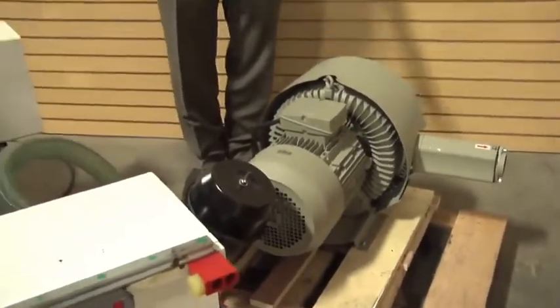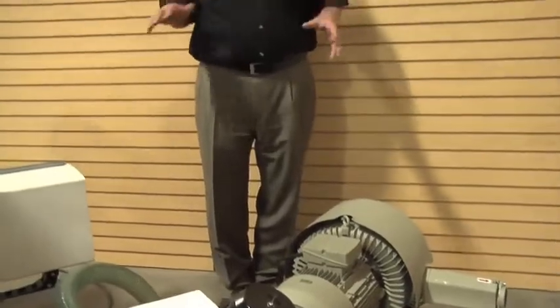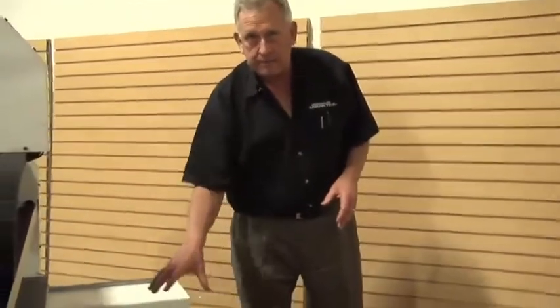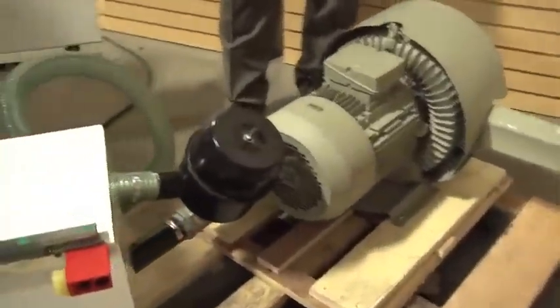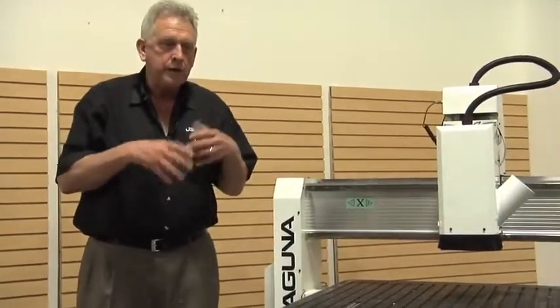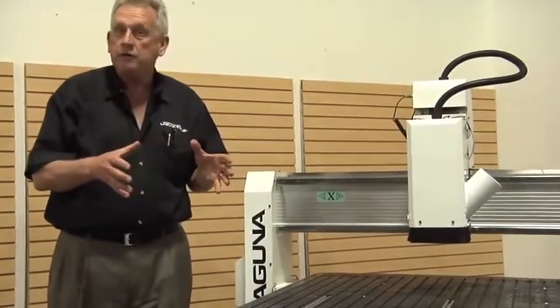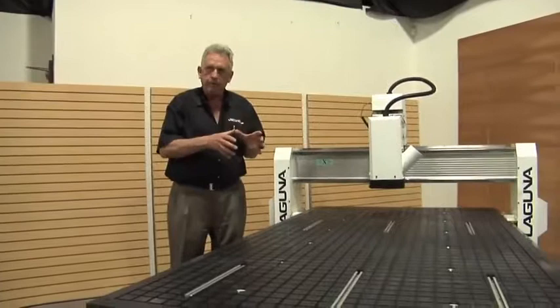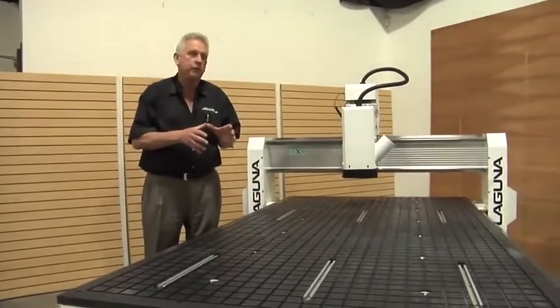I've left this one on the pallet because we move stuff around a lot here in the studio, but if you notice it fits really nicely in the space behind the machine so it doesn't take a lot of extra floor space. The Smart Shop one has a four horsepower liquid-cooled electra spindle. The electra spindle is liquid-cooled because we use these machines sometimes for long cycles — when you're doing 3D work, four or five hours is not unusual. Air-cooled spindles tend to get a little warm after that period of time; liquid-cooled don't. We can basically run them continually.